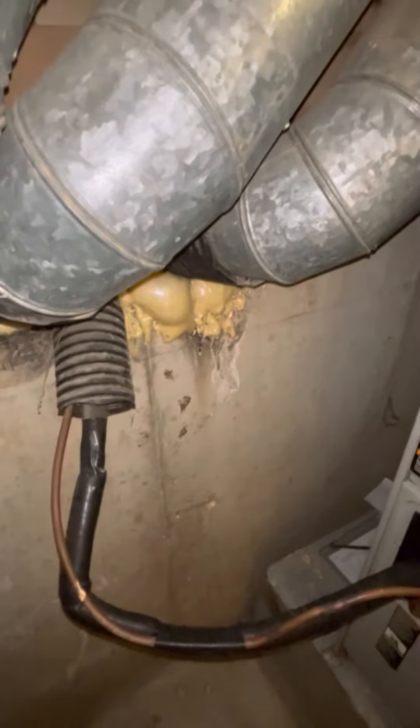The line set needs to be flushed and rewrapped to go through this gutter-type material outside — same with these. Overall it's a three-and-a-half-ton existing system as far as the indoor portion goes.